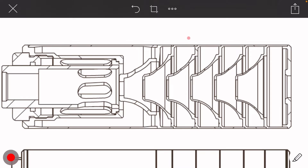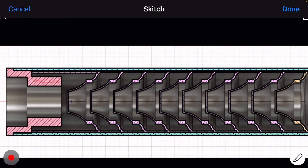The common lean has been towards a 250 thou gap between the first cone and the booster housing. In this picture we're looking at about a 150 thou gap, which has always been what I've used. Many people have used a 250 gap, and I always found that I liked the 150 more. I've never personally built anything with a gap smaller than that, so I've never really been able to attest if there's any benefit to going any closer.